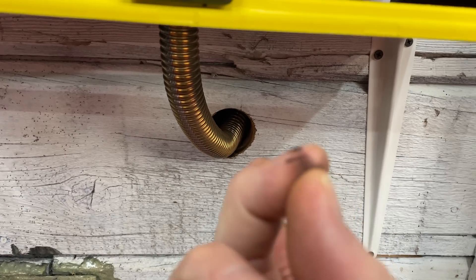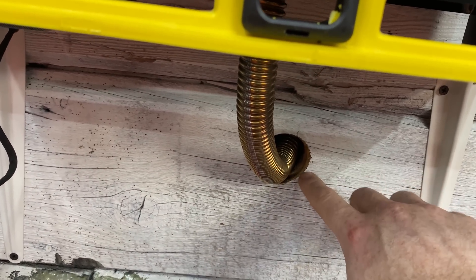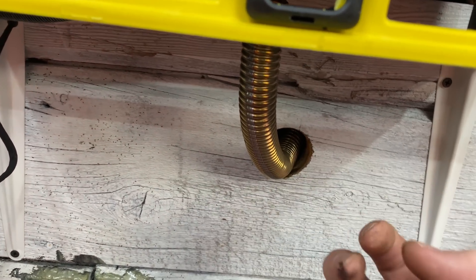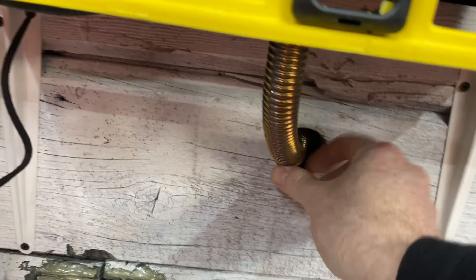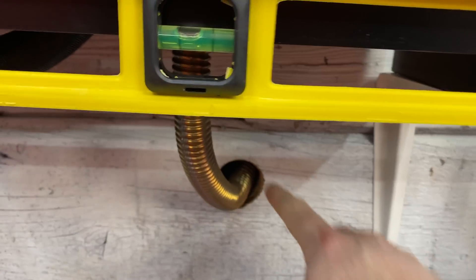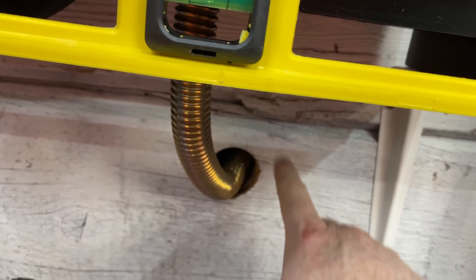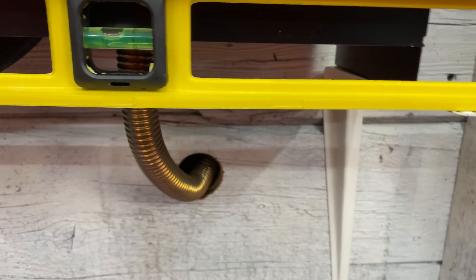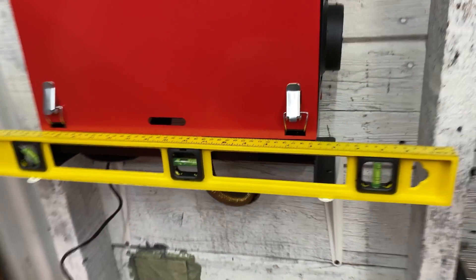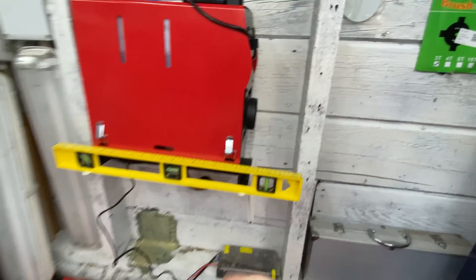This is why we test. I thought I could maybe get away with just insulation there. This black on my finger is from the wall — these are cedar boards and it burnt them in just a few minutes. That black is charred and I could smell it. So I'm going to make that opening about twice as big. I'll do a steel plate and ceramic insulation. I like knowing where the line is and where not to cross — that is definitely don't cross that line.